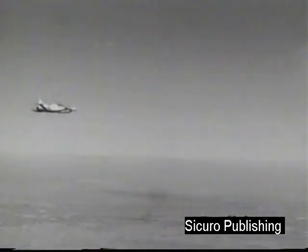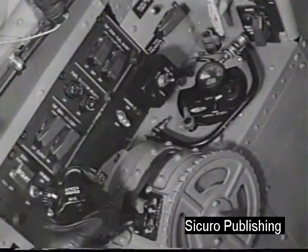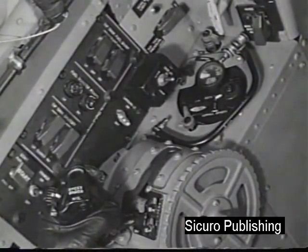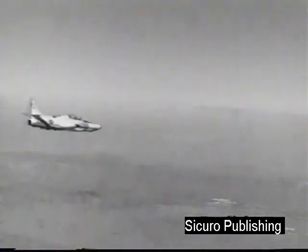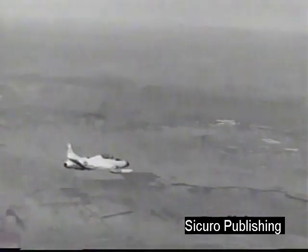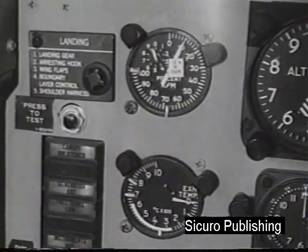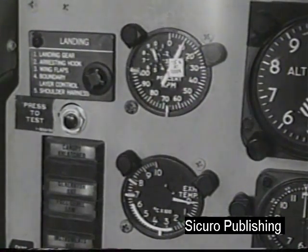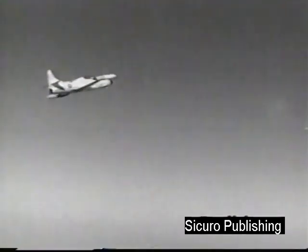The air start is another emergency procedure with which you must be acquainted. Immediately upon flame out, move the throttle to the off position. Maximum altitude for an air start is 25,000 feet. Descend to that altitude if necessary. Then assume a glide of 200 knots. At this speed, the engine will windmill at 8 to 10% RPM. Then drain the tailpipe of residual fuel.